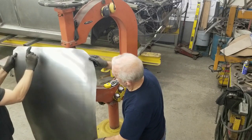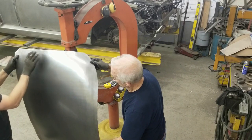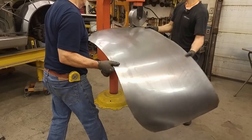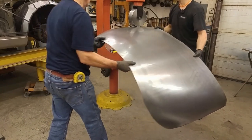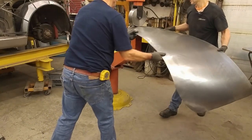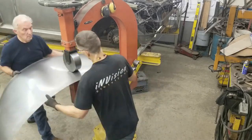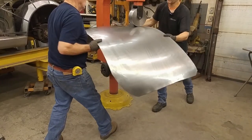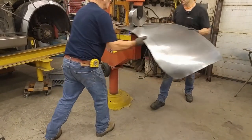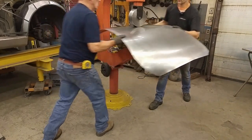That's going to roll over the door area, and about three-quarters of an inch will be rolled inside. What we do on one side we repeat on the other side. Once you trim the panel up a bit we'll touch it up a little bit more. Right now we're concerned about getting the shape right. Let's go lengthways across the front, touch this up, blend it in, and we can go try this.